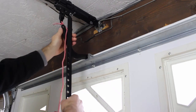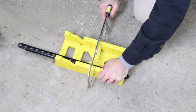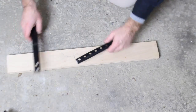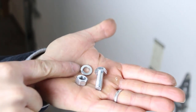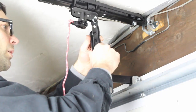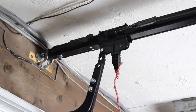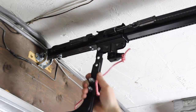The straight arm can be very, very long, especially if you've got a setup like mine. I tried using a hacksaw to trim it according to the directions — that did not work so well. So I used my oscillating multi-tool to cut through it, and it worked awesome. If you encounter the same thing, you may want to use your oscillating multi-tool to cut through that straight arm. Grab a nut, a washer, and a bolt — you're going to need two to attach the straight arm and the curved arm together. Hand-tighten those and then tighten them down using a socket wrench, because this is what pulls the garage door on the rail system.